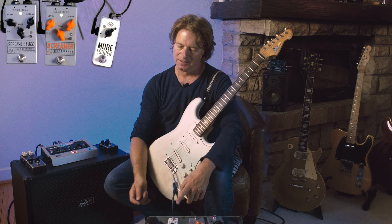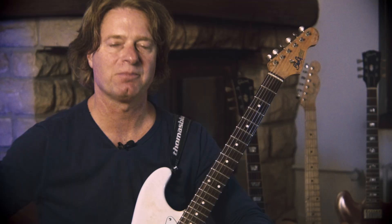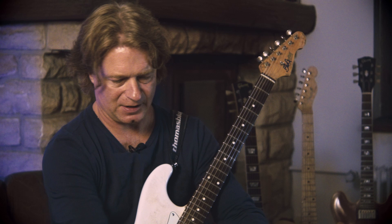So what's the difference? If you have a cable from the guitar to your first pedal, this is the natural load that makes the pickups sound the way they should sound. The second cable that goes from the first pedal to the next pedal or to your amplifier is then buffered, which makes the effect of the cable a lot less. So it's nice to have this option and there's your switch for it.